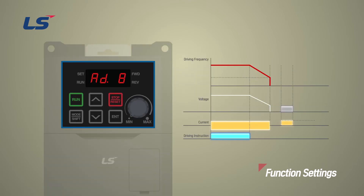Let's see how to program DC brake stop method by using the keypad. Press the Enter key in AD8 stop mode — a screen for setting the stop method appears. Move the cursor to number 1 DC brake and press the Enter key; parameters related to DC brake will appear. Press the Enter key at AD14 DC block time; a screen for setting the time appears. Set the time using the arrow keys and press the Enter key to complete the setting.